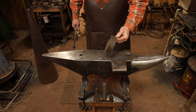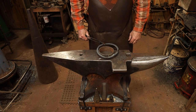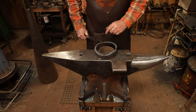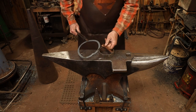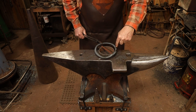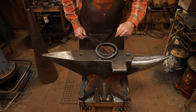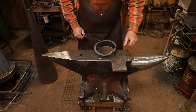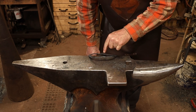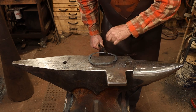Now because of my mistake at the beginning, we can't use this pipe as our final forming mandrel. If I had a piece of pipe the exact right size I'd show you what I had in mind, but I don't. My idea was to cut a notch in this that corresponds with the spoke so that when we have that welded up we've got something to clean up this transition and can still work it round. We've got the scarves overlapped and we'll weld this and draw it out just a little bit. I want to leave that thick for now because I'll weld my spoke right into that forge weld, but I'll wait to get a measurement on the spoke until I've got this all done.